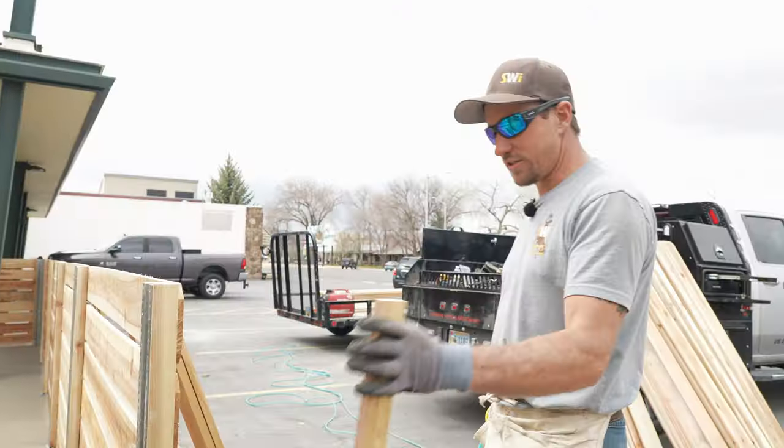All right, so nobody wants to have an awesome looking horizontal cedar fence and then, dude, I can still see the post. We're not like that though. We're gonna hide that post because you don't wanna look at it, and we don't want you to be mad because you do have to look at it. That's why we do the face cover pickets. We also do ones on the back too. Make sure it lines up with each side so we can cover those nail holes and make everything nice. We're gonna do one nail there. We're gonna line up everything else.